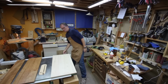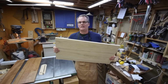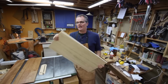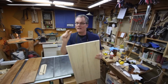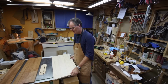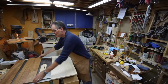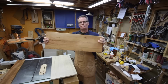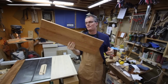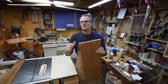Because I found that on a 15 by 30 inch drawer, the drawer front is 29 7/8 and 14 7/8. So 1/8 of an inch less than the dimension of the piece. And approximately, it's not perfect, so it's actually kind of a generous cut. So I then made my own drawer fronts. These are out of solid cherry, and this is for a 10 by 30 drawer, and so it's 29 7/8 and 9 7/8, and usually I just sort of nudge it a bit, so it's maybe on the plus side of the 7/8.